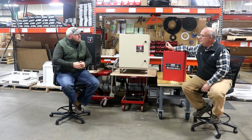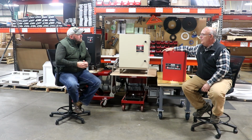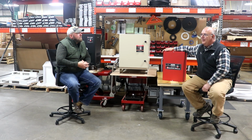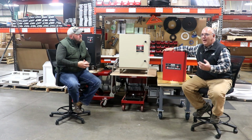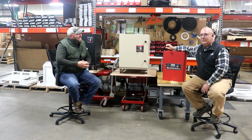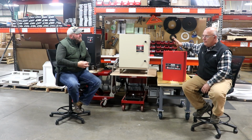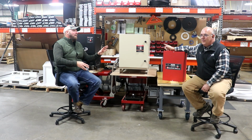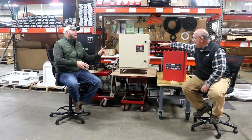But here's my biggest thing: the guy says, well, I'm only going to have this 1 mill, and that's the only thing in there. And okay, yeah, you might be able to get by cheaper, but then inevitably what happens is 6 months later, they're like, well, I've decided now I'm going to get a lathe, and now I'm going to get this. Well, now they've got 2 VFDs, they got 3 VFDs, they got 4 VFDs. Before long, Keith, let me stop you right there. You've spent more money on VFDs than if you'd just bought a phase converter.